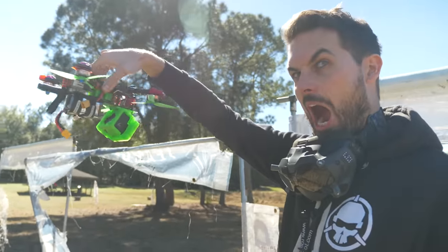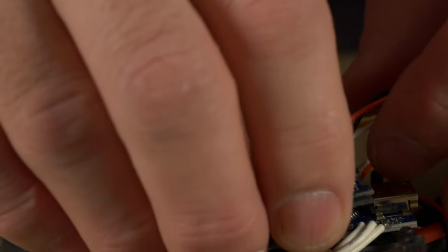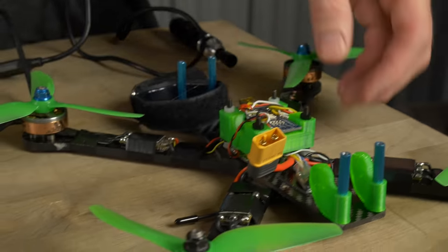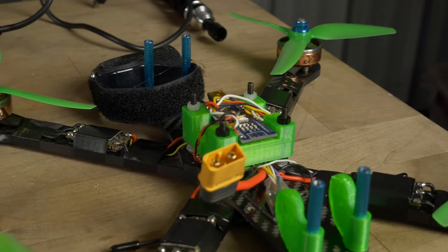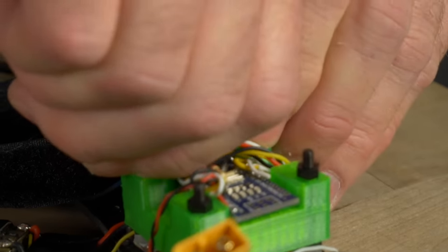When I originally built this, I didn't have a way to mount the flight controllers to the drone because they don't have the little 30 by 30 mounting holes that we use today. I ended up mounting it with double-sided tape in the first couple stages. Then I 3D printed mounts to lock them in place so they'd be more stable. It also added the soft damping effect of TPU that we normally get from the gummies on modern flight controllers, helping it fly a little better.